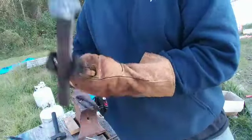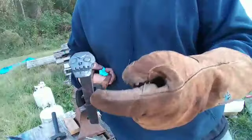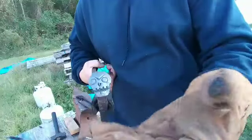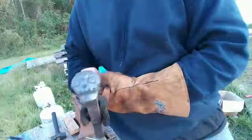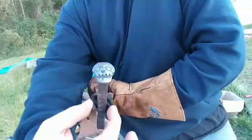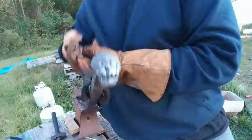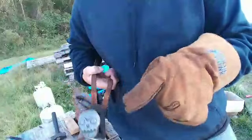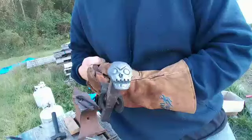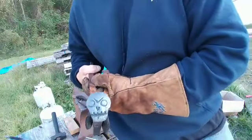Actually, before you start punching, you're gonna want to take it out of the fire and kind of shape the jaw to skull shape, obviously. Just take it out and put it on the edge of the anvil and just strike on the bottoms and kind of consolidate it in. That's it right there. Actually, I think I might put some little eyeballs in there. See how that comes out. So, yeah, I'm going to do that. So let's get it heated up. Try that real quick.